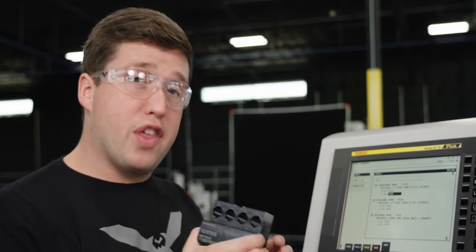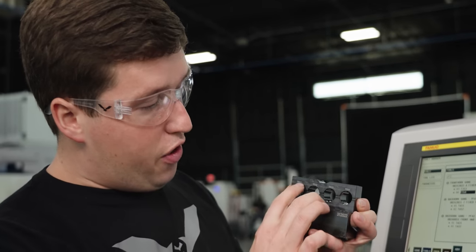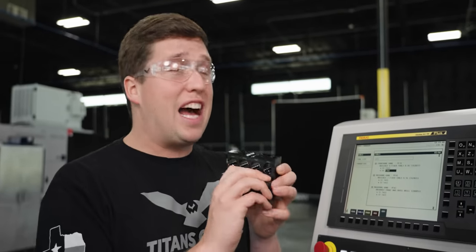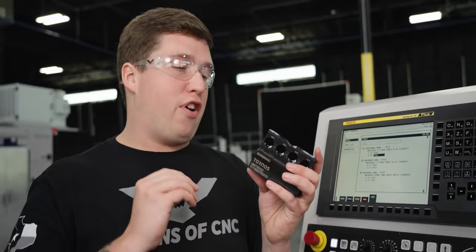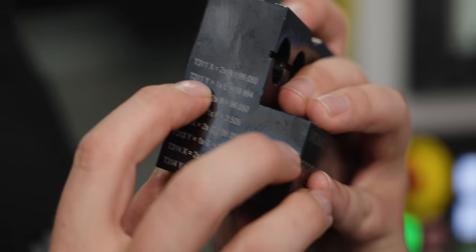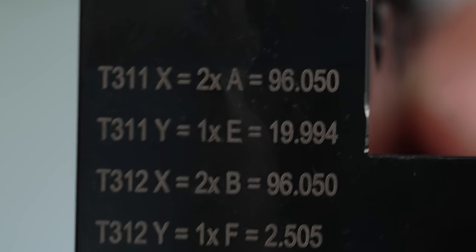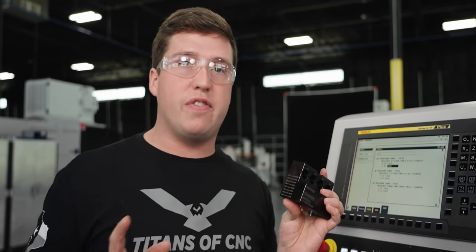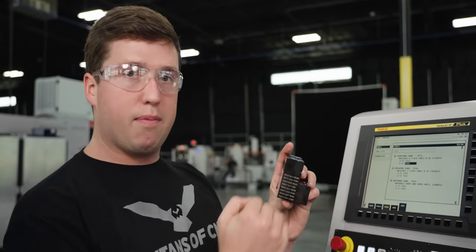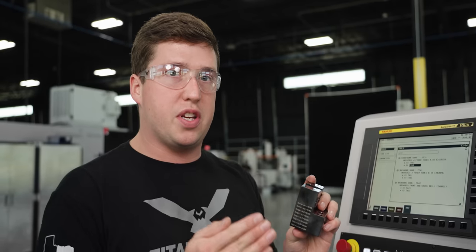And what's actually cool about this particular holder is they have all the tool station numbers already put on the holder for you. But even going above and beyond, which I think is wildly by far the most effort I have ever seen on a tool holder ever, they located and measured all the tool positions and put the exact numbers on the side of this. That is like overachieving to the max, in my opinion. The fact that they would, down to the micron, put all the different holder locations from center and from left to right on where these positions are. I have never seen anyone else bother to do that in their machines. I've been really impressed with the level of detail and craftsmanship in the Nano.